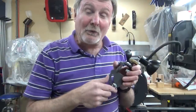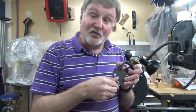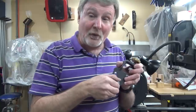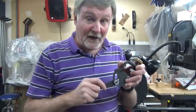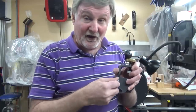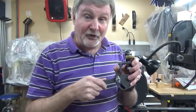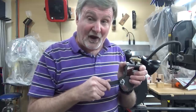Let's take a look at how we would set up our Vari-Grind jig in order to sharpen a spindle gouge. We control the amount of roll and sweep by loosening this wing nut and moving the position of the leg. I found that putting the leg in the top position gives us the best results for the spindle gouge — more roll, but a slight sweep side to side.